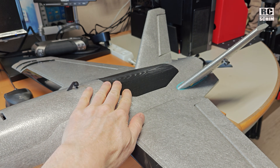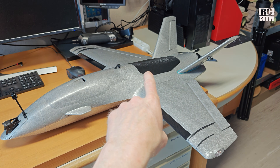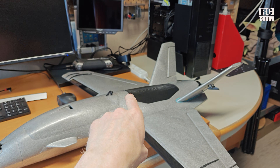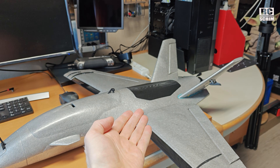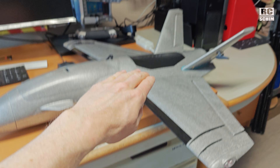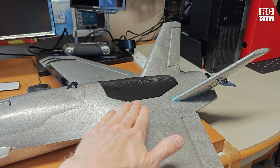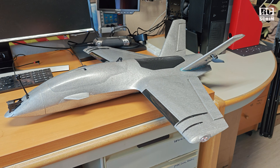It's a bit heavy — 83 grams. This might be 10 or 20 grams with better settings. I printed it with a lot of support, 15% infill, maybe even less. 5 wall loops, 4 shell and 4 bottom covers. Shell covers I would keep, because otherwise you get nasty artifacts. Bottom covers maybe less. Or else just buy the damn replacement part.